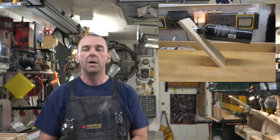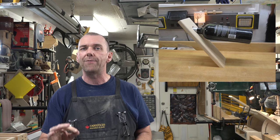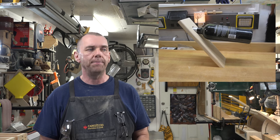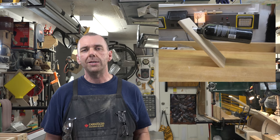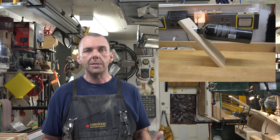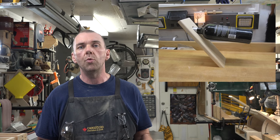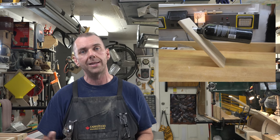And there you have it — a floating wine bottle holder. It's not the prettiest project; in fact it's one of the most simple projects you'll make in your shop. It's a flat board with some routing, one angled cut, and an angled drill hole. Are they fun? They're all fun. If you're making sawdust, it's a good thing, whether it's an intricate project or a simple one like this. Customize it however you like — add scrolling, wood burning, staining, or some char accents. Make it wider or thicker if the three-quarter inch feels a little wobbly — double it to an inch and a half.